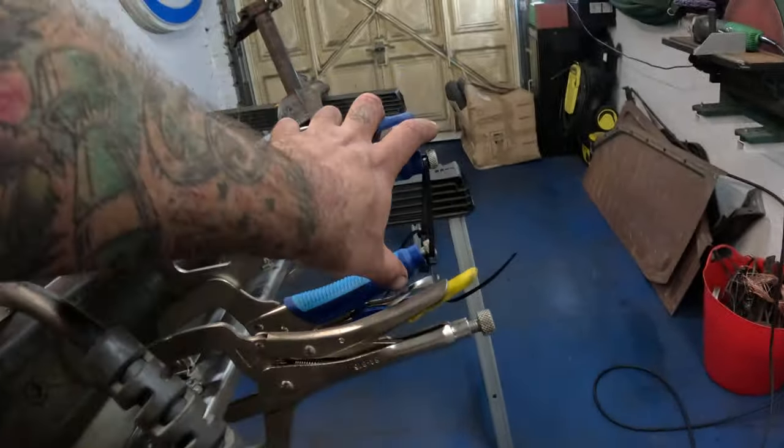That's it, ready to be tacked in place. I've gone round and sanded off all the paint inside and out so we get a nice clean weld without any contamination. So the plan is tack it on the bottoms there. Obviously we've got our string line running through our pen marks there so that we know everything's all straight. We'll tack it on the bottom and then gradually work our way up, making sure that these two pieces of metal are as flush as possible all the way up, and basically sneak up on this top portion here until we're all the way up this side, all the way up this side, and I can get this part welded in, and then we can get to work on filling up those gaps there. Let's do it.